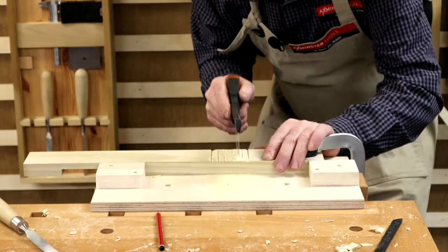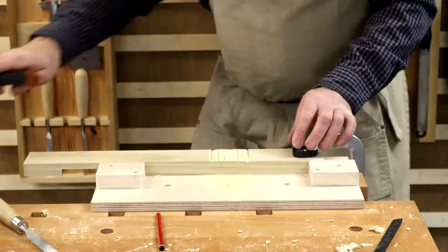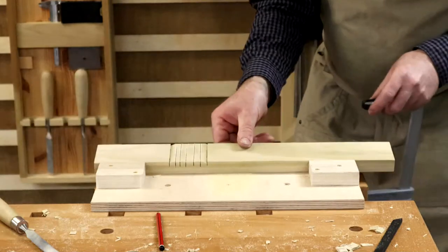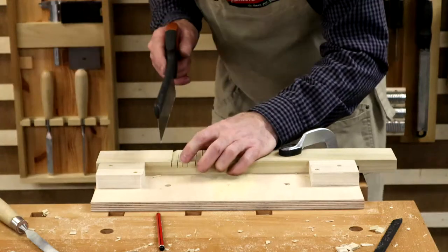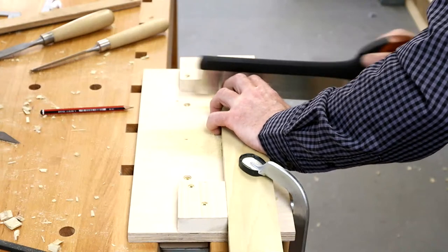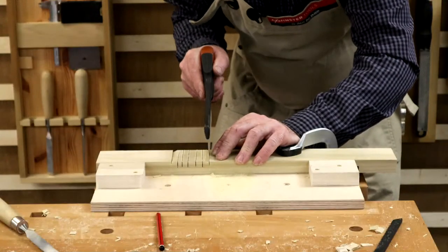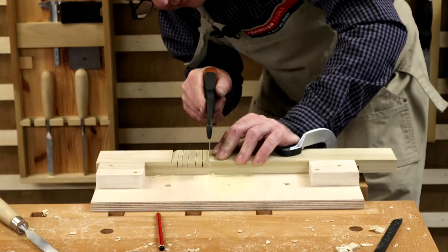Another one in there, it's a bit tacky out. So again, we're tilting the saw down towards the floor a little bit because I can't see what happens on the other side. So I flip it around. Up against that knife wall we've done, fingertips are just working on the left hand to support the blade. The cutting edge is below the surface. This side, I need to probably be left-handed. Better.